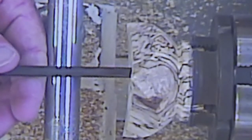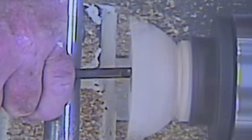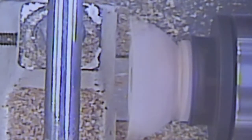on the hole that I drilled with the 5/8 Forstner bit, I'm not trusting that that was going to run exactly true. So I'm going to use a 1/4-inch spindle skew. And I'm just going to go in with my long point and take off a very little bit. The reason I use a round skew is the back of the round is actually my bevel, and it's going to burnish the inside of this lid area. On the very inside, I'm just going to chamfer that, just so it's not sharp in case somebody did put their finger in.